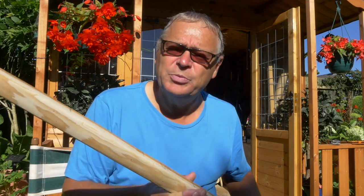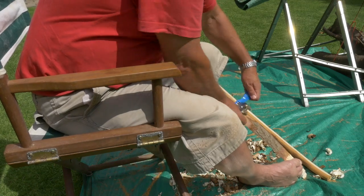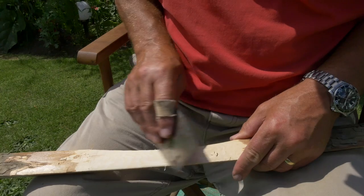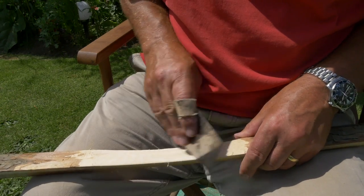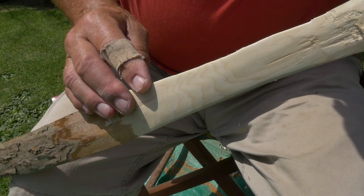Yesterday I spent time with a rasp and a spokeshave, starting to shape this bow to create a D-shaped or flat D-shaped belly and tapering the sides a little more. During that time it became more and more obvious, even to my inexperienced eyes, that I've got to reduce the layer of sapwood on the back. Many people messaged me and said the same. So I took a piece of the offcut from this stave and had some practice with a cabinet scraper, a spokeshave, and some sandpaper to try to get a smooth effect and to see what happened when you cut through growth rings and how to feather them, making them run diagonally across the bow where necessary.